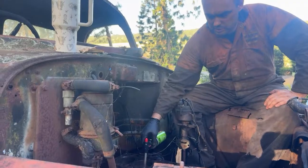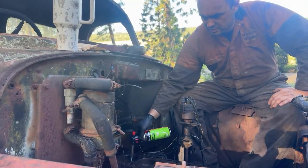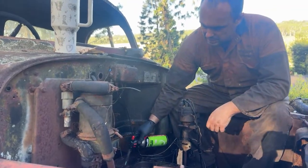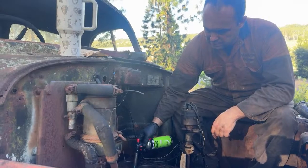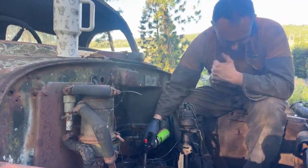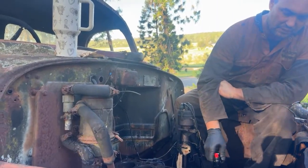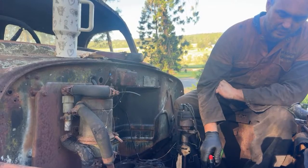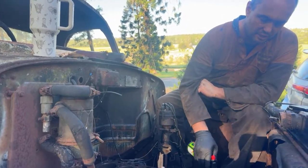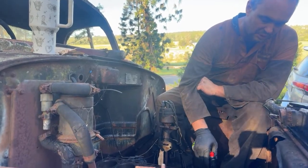The grader worked good, Wayne. I used it yesterday. Actually, I had to move it out of the shed to service the car, so I found out what the starter problem was after buying a new battery. Because I had to move the bell housing to line up the centre of the flywheel with the bell housing, it's now moved the starter closer, so when it was thrown in, it was jamming on the flywheel.